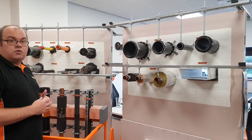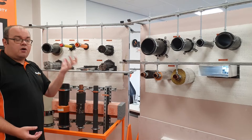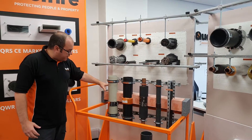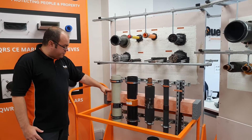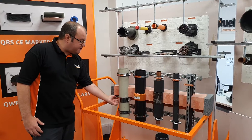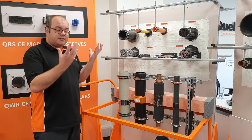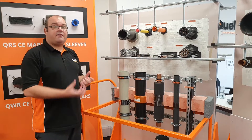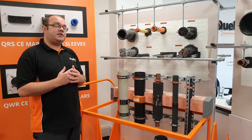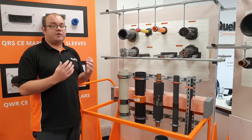We've not only tested on walls — we have also tested on floors, so we have direct-to-floor details. We have one fire collar on the underside, and if you have an oversized hole you could utilize it with our QF2 fire protection compound, as shown here with the QWR Fire Collar fixed to the underside. We also have unique substrate features such as the profile deck, where you would fix some Quellstop fire bat on the underside and then fix the fire collar to the fire bat. Quite uniquely, we've also tested on both a single skin and double skin plasterboard ceiling on timber joists.